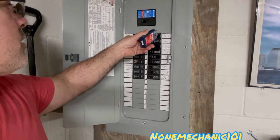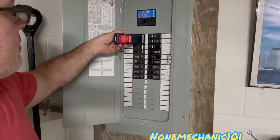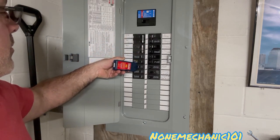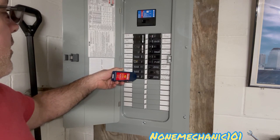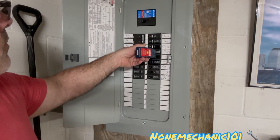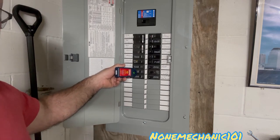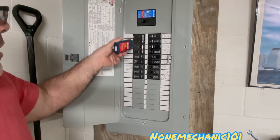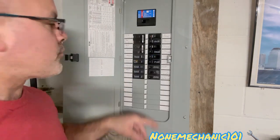Okay, we went through each one one time so let's go again. I think this one rang the first time, but it's not ringing now. Oh — that one right there, it looks like it's it. Let's keep going. Okay, so it seems like it's this one here. They also want you to hold the receiver this way when scanning. So let's shut this off — this circuit breaker here, according to the receiver.